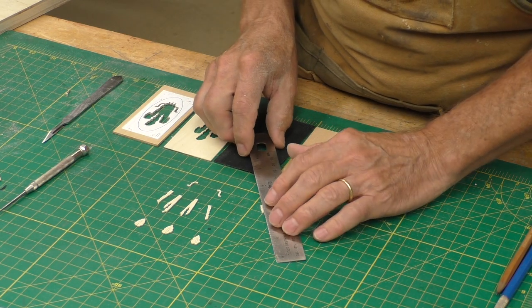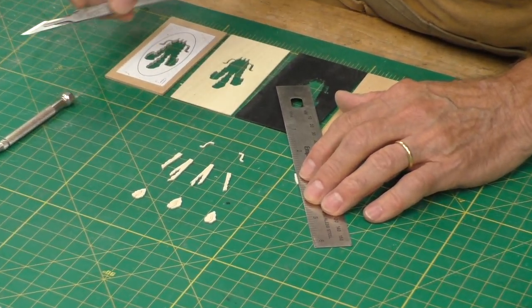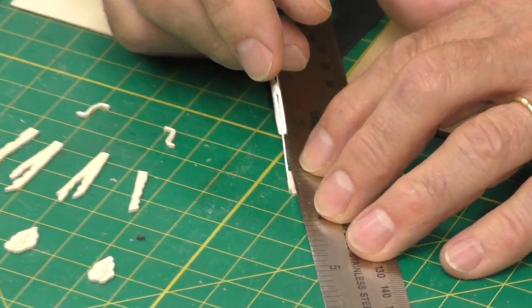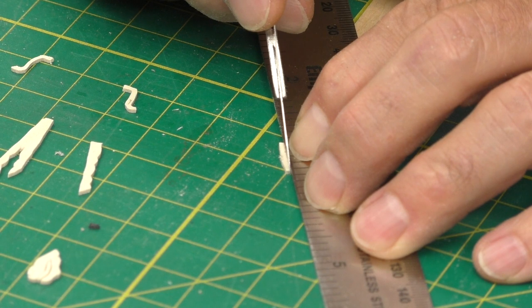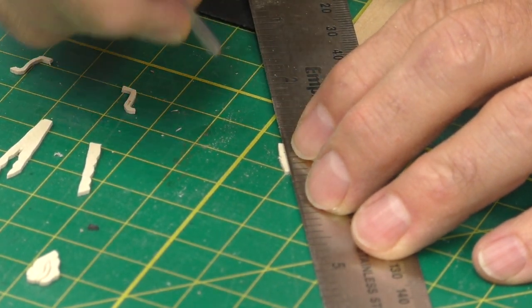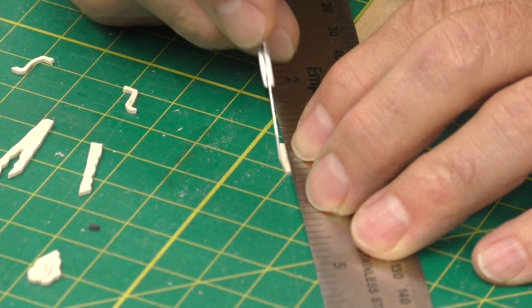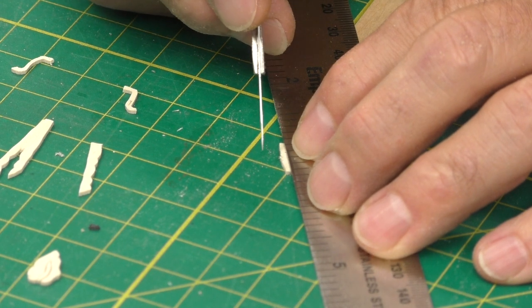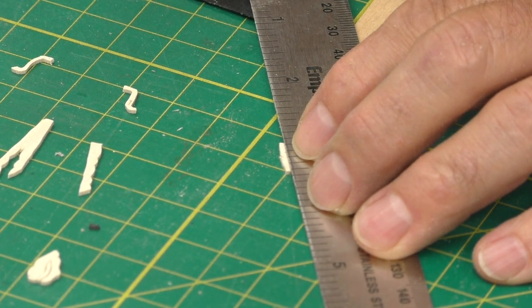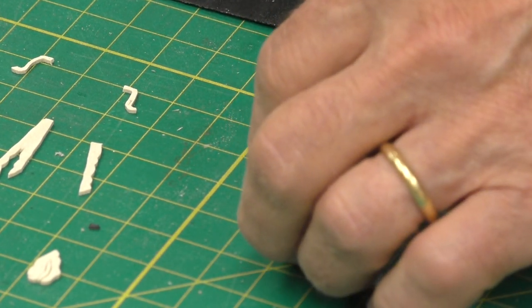And what I do to cut off the top of that is I'll take a scalpel, and I just set a straight edge on the top, and I will score the top of this line repeatedly, and I always work from the side where the edge is. Work from the edge in, and I'll turn around and work from this edge in that way, and run through that, score it 10, 20, 30 times until I finally get it to break off. If I tried to put a big chisel on it and punch it, it would just crack the entire piece of veneer. I learned that the hard way.